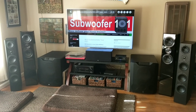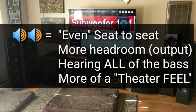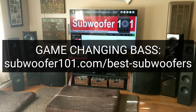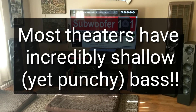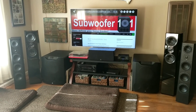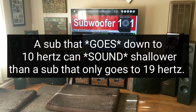Not only all the seat-to-seat and improved output benefits, but there's also the intangible — it feels more like a movie theater. And if you go with the subwoofers on the list, it goes way deeper than most any theater you've been to. A basic theater goes down to about 40 hertz; most of the subs on my list tend to go down to about 14 hertz. That's a noticeable and powerful difference. The list really explains in depth why I have these specific subs, and another topic I'll tackle is the difference between going deep and sounding deep — a very important distinction.